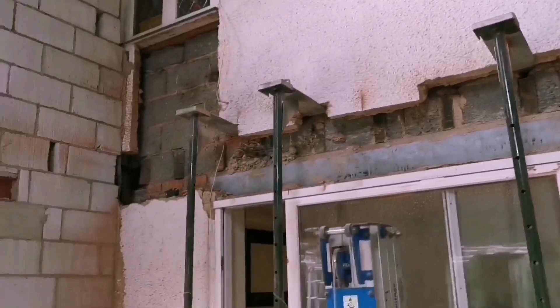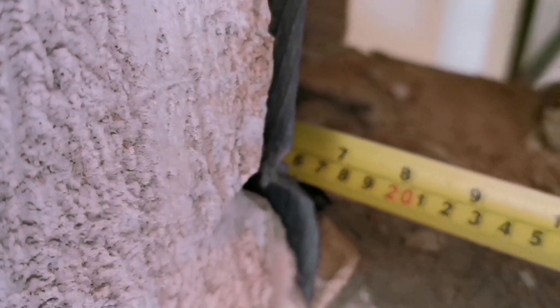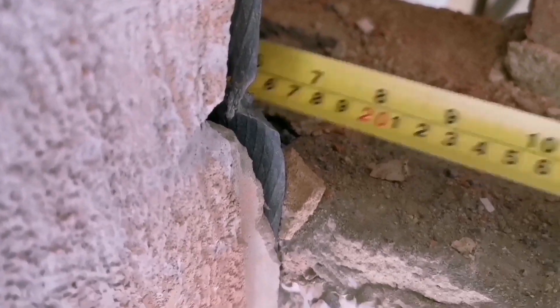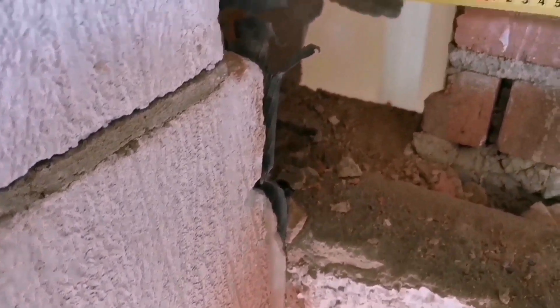So that's the next job — getting those pad stones in. We're up on the scaffold and we should have 150, maybe a bit more. I gave it 170, so 150 bearing on the pad stone, which is great — 20mm gap. Good stuff. It should be the same up the side.